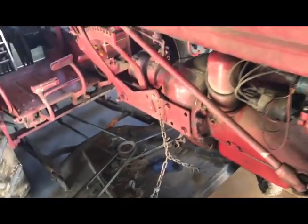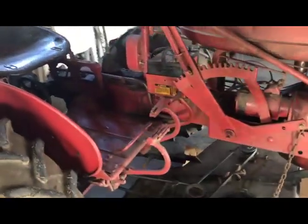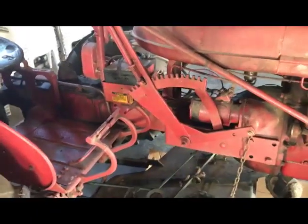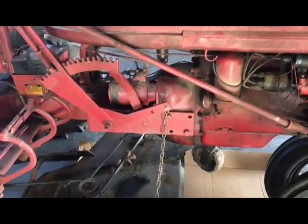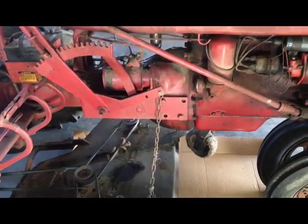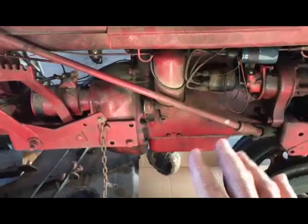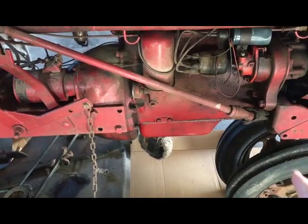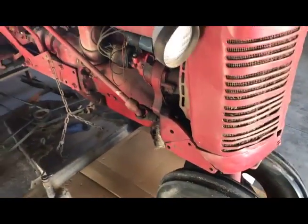That's what we're gonna be working on, so y'all wish me luck. Let me know what you think about rolling in the bearings — that is my plan unless I get in there and the journals are just mangled. But it doesn't really feel like that's gonna be the case. This is an October '41 production block. I don't know how many times it's been rebuilt. I think it's late enough to accept the oversized pistons and sleeves, so it might be a 123 instead of a 113. At some point we're just going to completely rebuild it, but right now I've got to get it ready to mow grass this year.